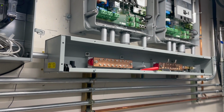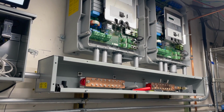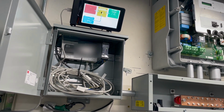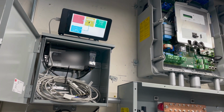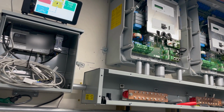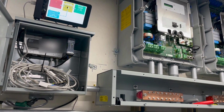right now I'm just using lead acid, maybe down to 70 or 80%. I'm going to try to cycle these down to 20% every day, and then I plan on leaving all the loads on at night except for the air conditioner. And by on, I mean that this off-grid system would provide the power to them. Of course, I would try to reduce my load by shutting things off, but there's water heaters, there's things that come on cyclically.